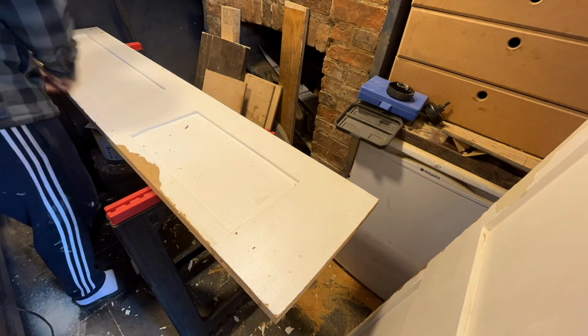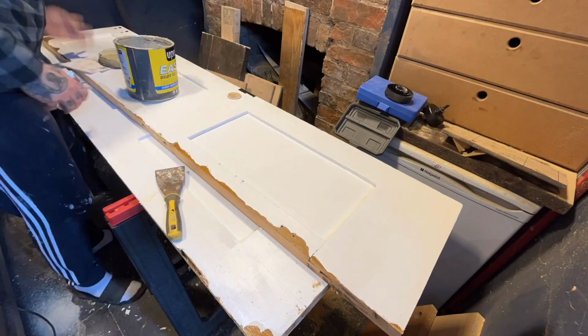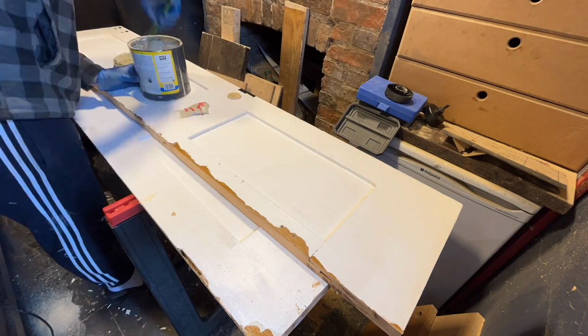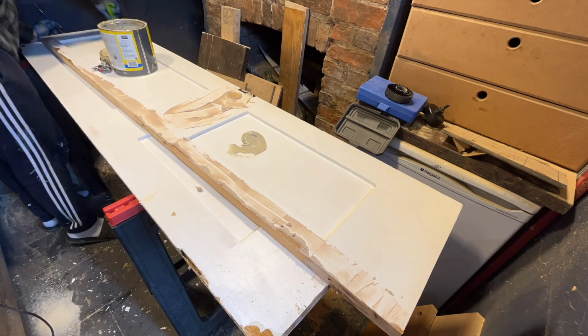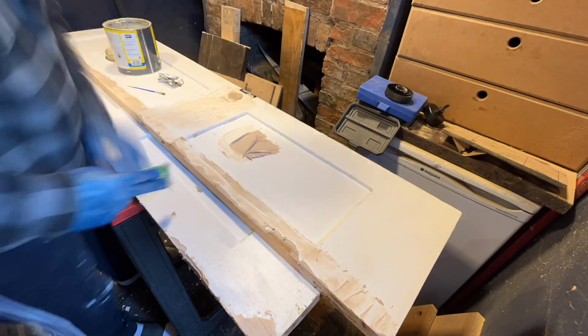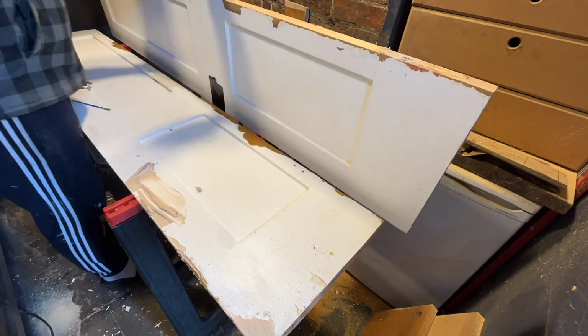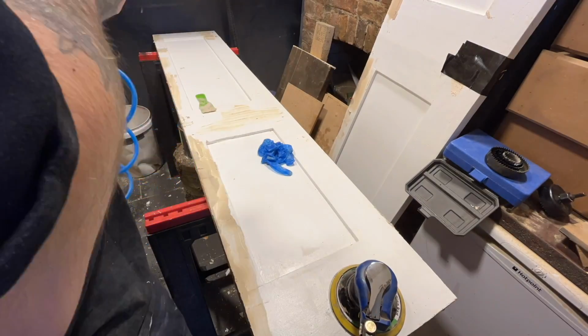Because this door had many decades worth of paint on, the bits that peeled off when it was cut left a large step from the wood to the top of the paint level. This wasn't going to be easy to sand without sanding all of the finish off, and with the possibility of there being lead paint under the first few layers, I thought it was better just to fill the edges of the paint and then sand this flat instead.